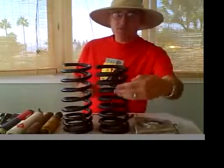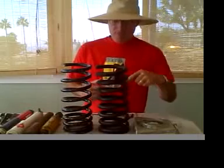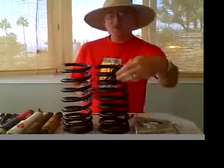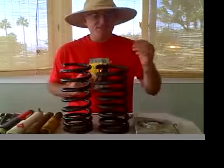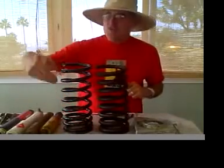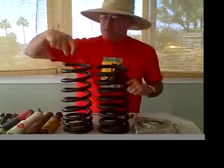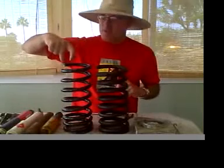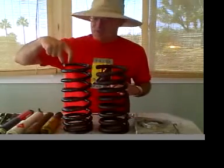This here is an original spring from the Fossel II, and it has eight and three-quarters coils that are evenly spaced. This is a brand new spring that was made in the United States, unlike this spring which would have been made in France. This has got eight and two-thirds coils to it, and we tried to match the coil thickness as closely as we could. You'll see that this is one-half of a millimeter thinner because it was made in the U.S. to U.S. specs.